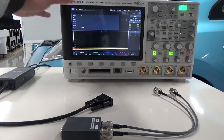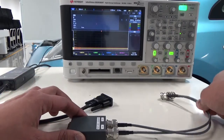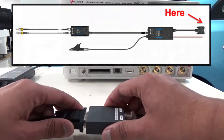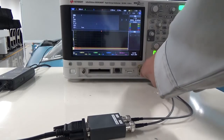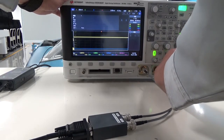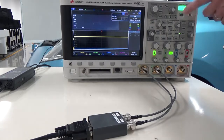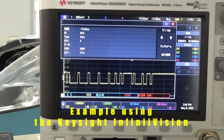If you are using an oscilloscope for CAN monitoring, use a DSUB BNC conversion adapter. Connect to the output terminal of the CAN sensor and connect the BNC terminal to the oscilloscope. The nice thing about oscilloscopes is that you can see not only digital data but also signal patterns. For example, if you look at it with an oscilloscope, you can quickly see in which bit of the CAN frame the error occurred.